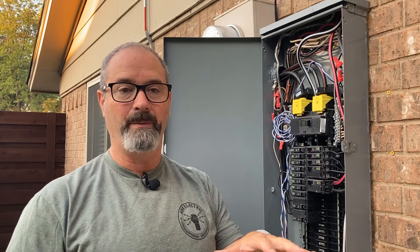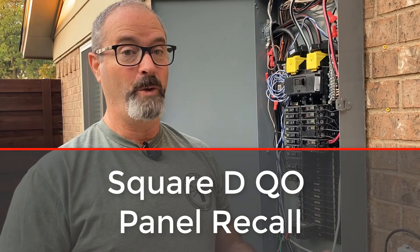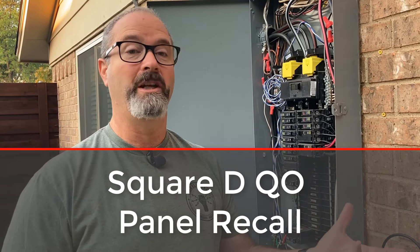Message me because I have a link, or you can find it online. Square D has published how to see if your panel is part of that recall. If it is in those dates and batch numbers, you basically get a torque screwdriver and follow specific instructions. They want a qualified person to do the torquing, so you electricians and guys with tools — there you go. Homeowners, if you are worried about that, you could check it, but that's the Square D recall.